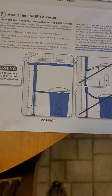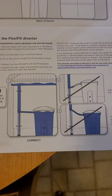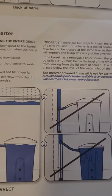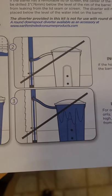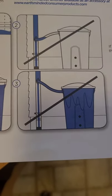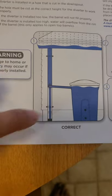If you follow the instructions, it's not too bad. One thing I found pretty interesting: when picking the location for your rain barrel, you want to make sure that the angle is correct. If you put the diverter kit too low, your rain barrel won't fill. And if you put it too high, you can overflow. That only applies to a trash can or something without a closed lid. If you're using a 55-gallon plastic drum with a closed lid like I am, that's not as important, but I'm going to try to keep mine more leveled so any excess water can come out and back down to drain.